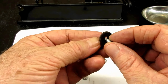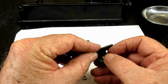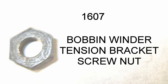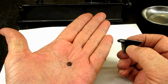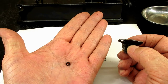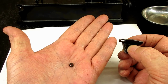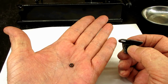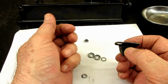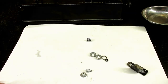The tension disc screw goes through the hole in the bracket - it doesn't screw into the bracket, it goes through it - and then there's a little tiny nut on the end to tighten it all together. For the socket size, a five millimeter was too small and a six millimeter was too big. You want about a five-and-a-half millimeter, which correlates to a seven thirty-second of an inch socket.